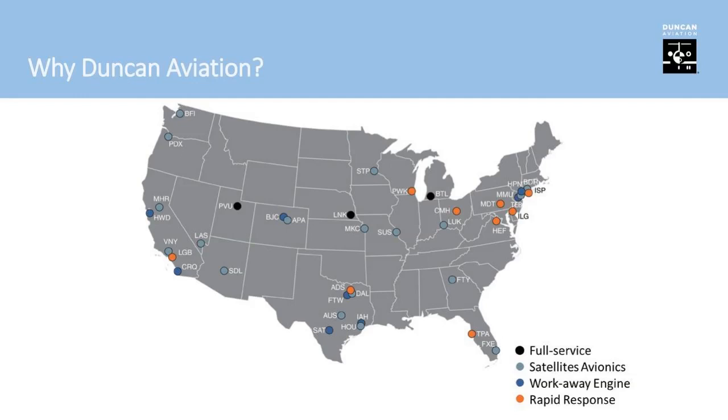You take a thumb drive, stick it in the center display, and it takes, how long does it take, Jeff? Just 10 minutes? Not even 10 minutes, just a few. It's 5 to 7 minutes is what it was on the initial ones that we were doing. So no more of CPAS where you're taking an hour to possibly load it correctly. Sometimes they have that failed load and have to start all over. This is something that can be done on battery power, without having to worry about draining things down.